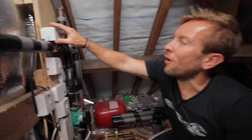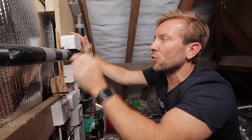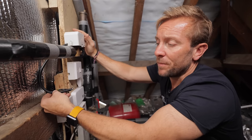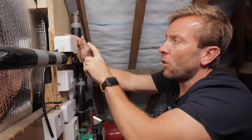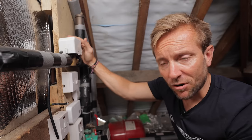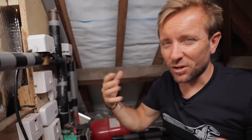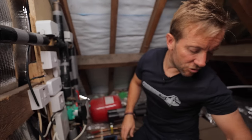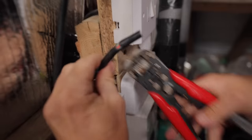Then what you do is you whip off your old one of these if you want. The only way this method will work is if you put the same model of head back on - not only because it's got to fit the body, but also because the wiring has got to be the same. If you're going to change over the body and put a totally new valve in, make sure you know what the signal wires do. They're all pretty much the same - they have a live, earth, neutral, and then two signal wires. Just make sure you know that. Then get your wire strippers out - it's quite a fat old bit of wire this.